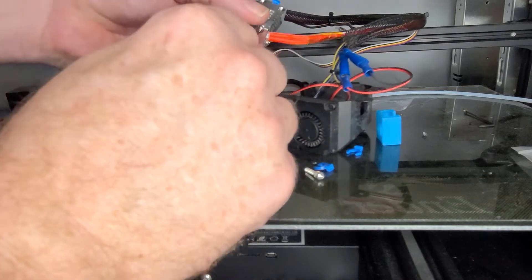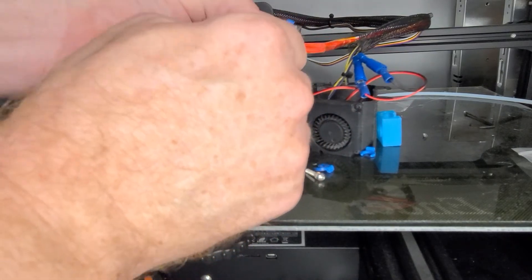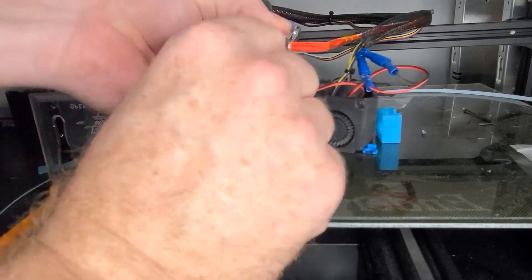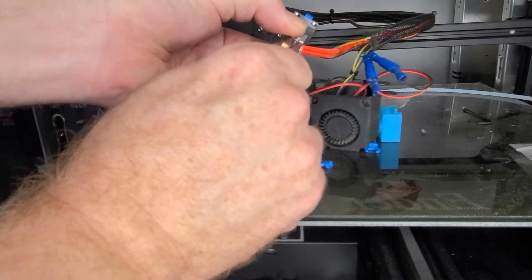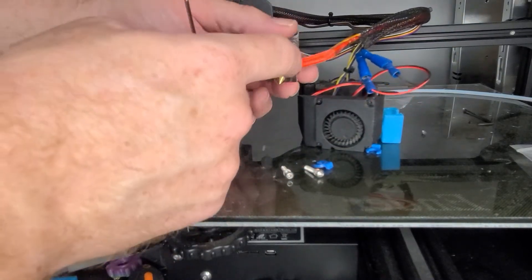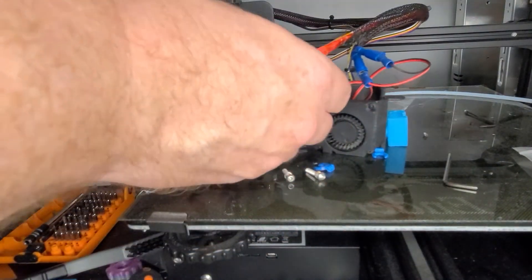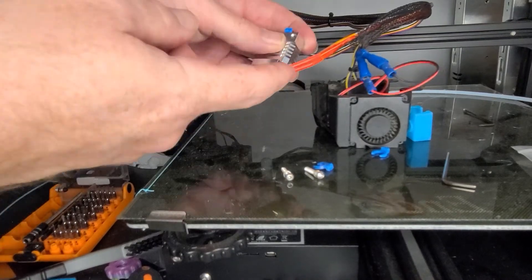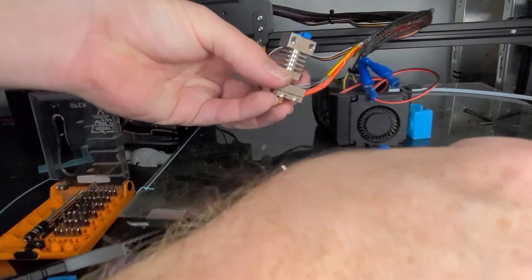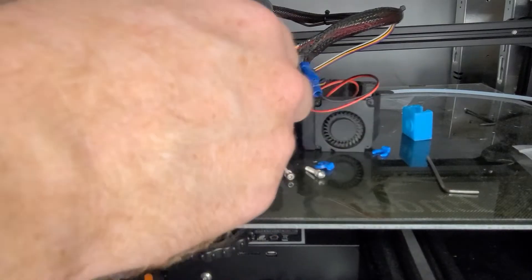Keep your finger on there to make sure it's all flush. Hold it by the hot end, not up here — hold it by the heat sink, not up here, because you don't want to twist and put weight on it, as you could possibly break it. This has a much better Allen wrench connection than the Micro Swiss does, so based on that alone you're going to get no play here. On the Micro Swiss I was getting a lot of play. Tighten it down — that's it, now we're all together.